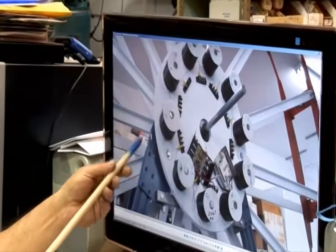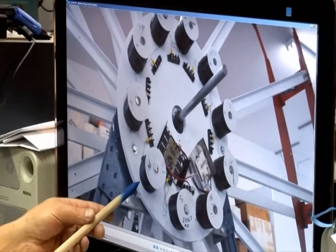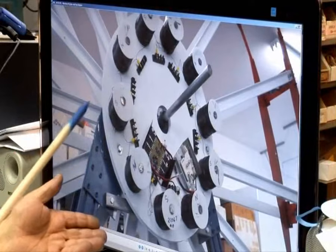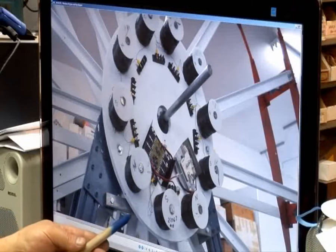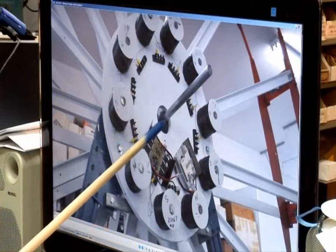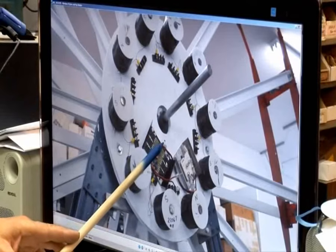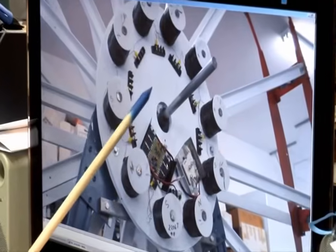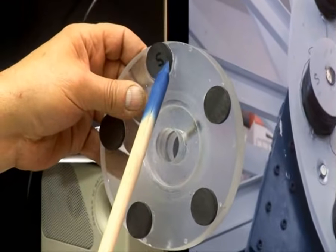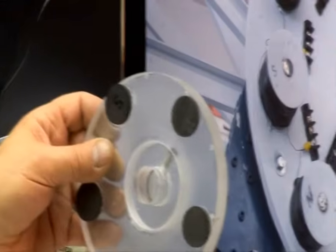On the back here, right in here, these poles, there's a hole drilled through the wood because the wood is a diamagnetic material, and then there's a magnetic material behind it. This is a steel plate, 1/8-inch steel plate, filling the entire space of this piece of wood with a 2-inch hole cut here. Now notice this circle? That fits the exact spacing so that when this magnet spins, it goes through this arc and gets the travel of exactly 1 inch on this plate.